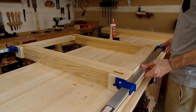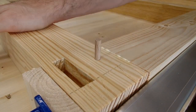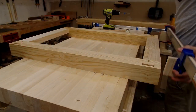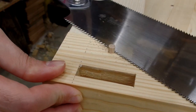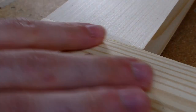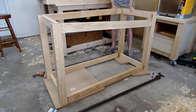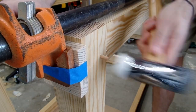With all that done, I could assemble the short sides of the base first. I probably should have used larger pegs than the quarter-inch dowel I used, and I'm not sure how much the draw bores actually did anything since I probably didn't offset the hole in the tenon enough, but I still think they look cool and were fun to hammer in. Once everything dried, I cut off the pegs and flushed everything up. I then repeated the same process for the longer sides — drilling out the draw bore holes, gluing the entire base together, hammering in more pegs, and cleaning everything up once dry.